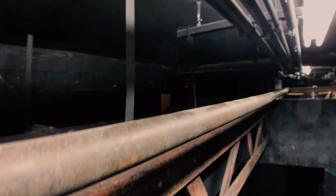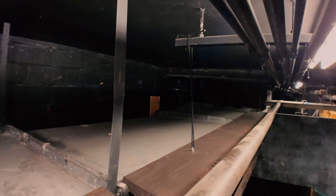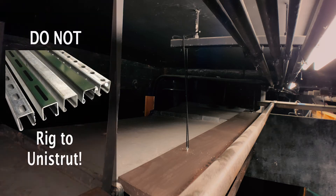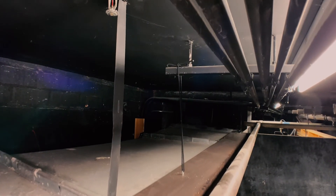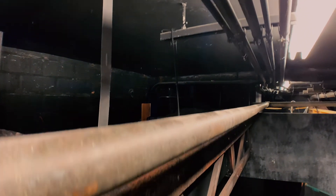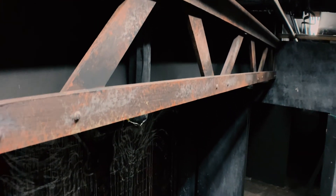This whole beam runs along this pipe and there's nothing attaching to it as part of the grid. We have another attachment point over here — this one's even more frightening. The eyelet is attached to a piece of unistrut, and that little tie line could easily just slip right off the end of the unistrut. Not that the tie line is even rated for this, but at least put it on the other side of the hanger bolt so it can't slip off.